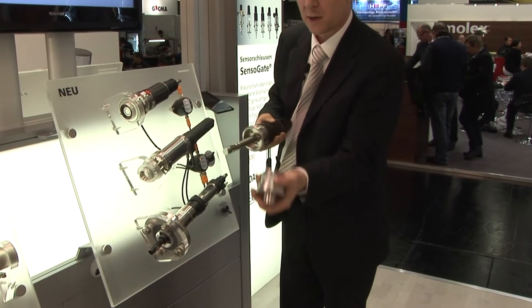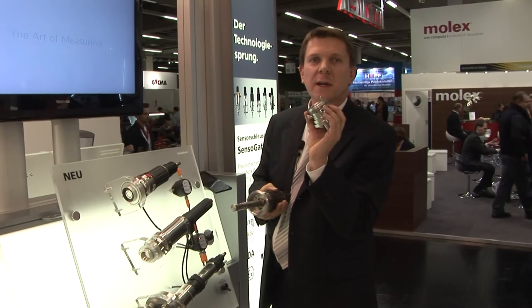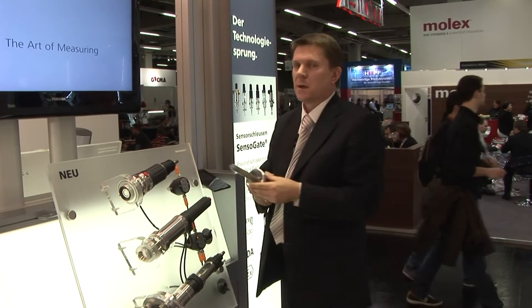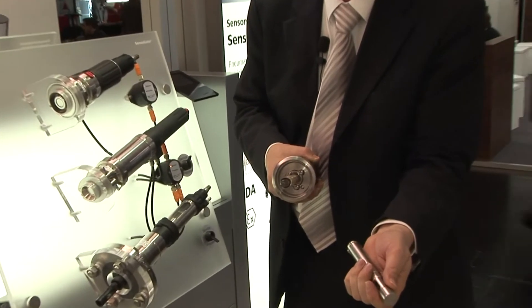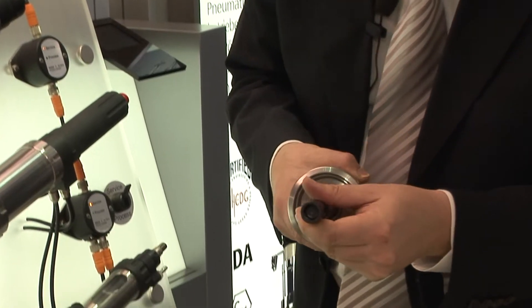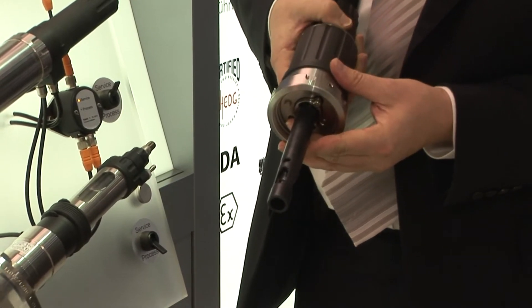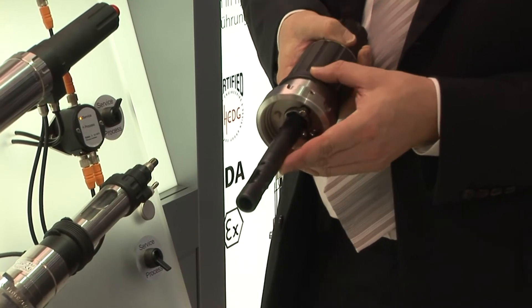Taking it apart — this is the calibration chamber. You can see that we have both inlet and outlet on the side. The bayonet gives you the easy possibility to replace the immersion tube. When we connect it in this area, we have a PEEK version of the immersion tube, which has a far higher chemical resistance than the stainless steel version.